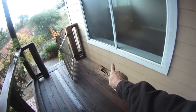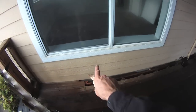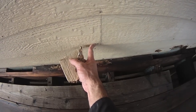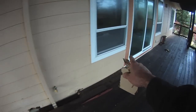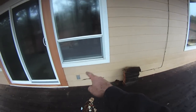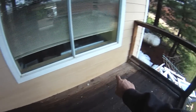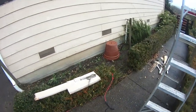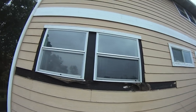Those two boards up, I'm going to go probably from this seam over to there. I'll go from that seam over to the door and replace those two from that trim piece to this seam, and then this bottom course maybe all the way up to this seam. They've got it bolted there to there because this section is in good shape — a couple minutes with a sawzall and a carefully placed hammer.